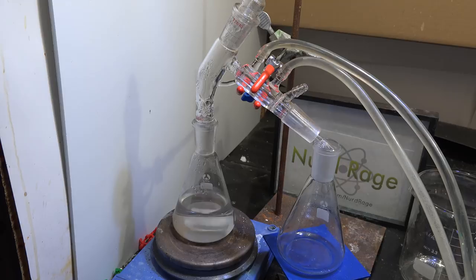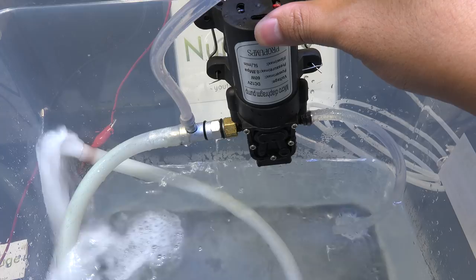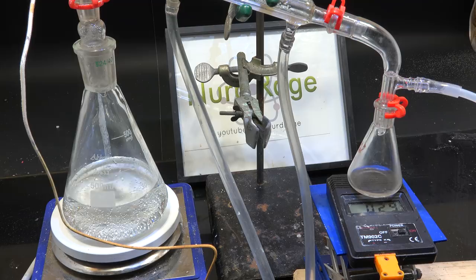Use small flasks to reduce the distance, otherwise this will be no better than full size apparatus. It also helps to tilt the flask so the liquid is as close as possible to the apparatus without spilling over. Vapors travel sideways better than they travel straight up. Also use a vacuum whenever possible — if we can reduce the boiling point with a vacuum and distill below the boiling point, we can stack two advantages to distill extremely difficult substances. It's also necessary to get a reasonable flow rate.